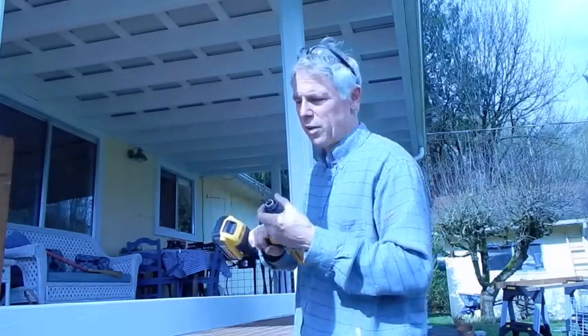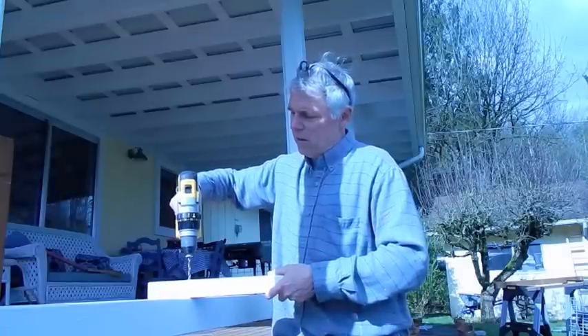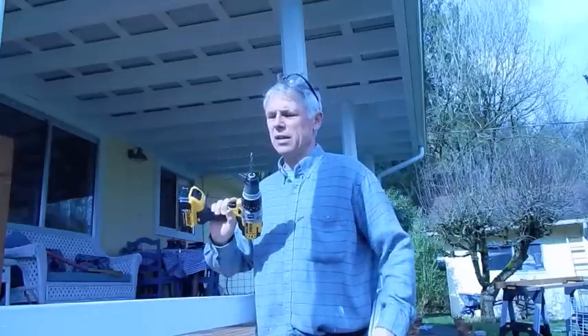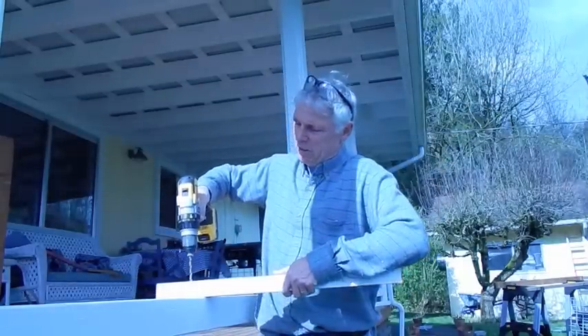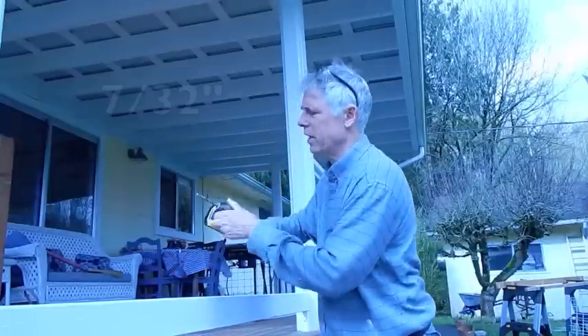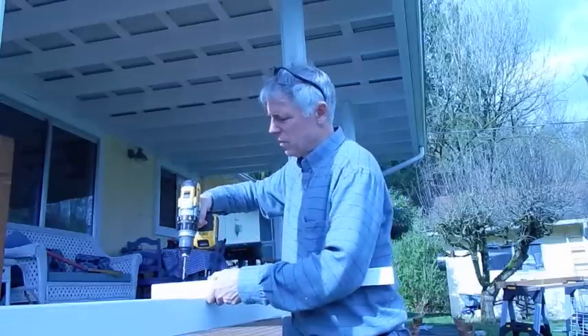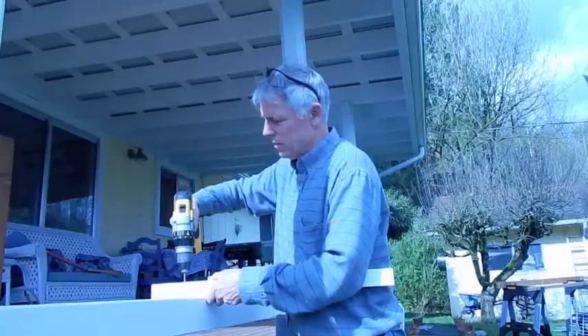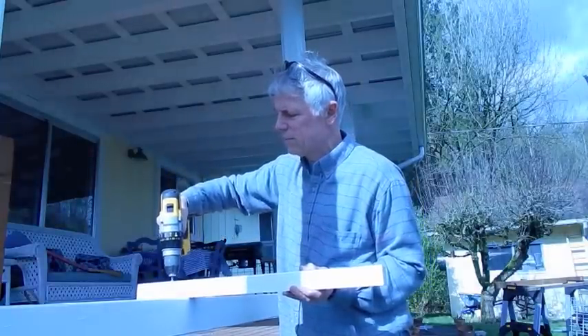This is my 9/32-inch drill bit. I'm going to do two little pilot holes starting at about five inches out. The 9/32-inch is basically just to give a little more room for the head to slip in the groove. The screw head will actually seat at the bottom of this groove. Now I'll switch out to the little bit. Once you get a system down, it goes pretty fast. Now we stick our two and a half inch screw in there.